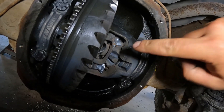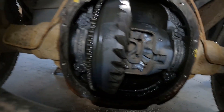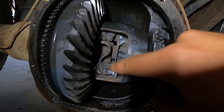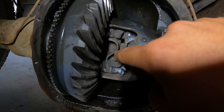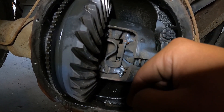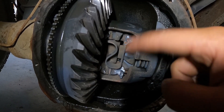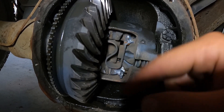So I just finished welding this up. I ain't going to get real close because I ain't real proud of them, especially the ones back behind the ring gear. There is a better way to weld up a rear end if you're going to do it — especially without this spring in the middle if you just have a regular open carrier. You can build a square plate that fits inside the four spiders and weld it solid, but this will work for what I'm doing.